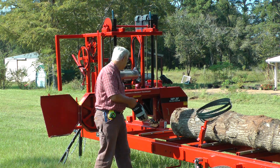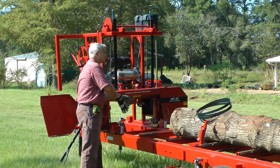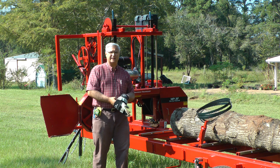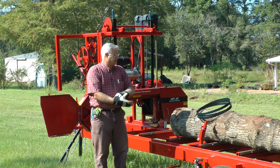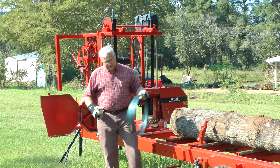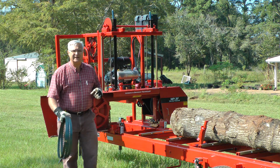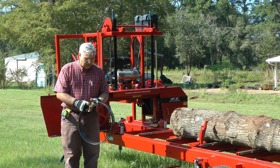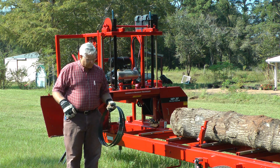We just came out to this mill here. This is an MP32 that has 19-inch band wheels and we've left it tensioned sitting here. Our experience, and in talking with customers, we have found that it is not detrimental to leave that. But I'm going to put some caveats in here in just a minute about different types of wheels and how that may affect it.